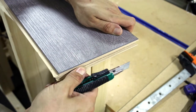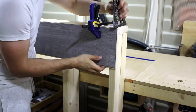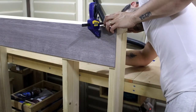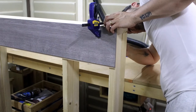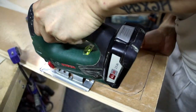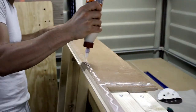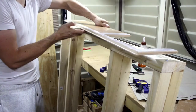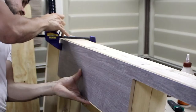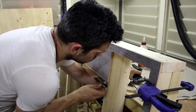When the structure was ready, I began gluing the laminate flooring to it, starting with the top row. After placing and holding it with a clamp in its final position, I simply outlined the structure onto the laminate floor — this will be the location of the shelf — and I cut out this area with my jigsaw. I glued it and waited for the glue to dry. For the top row I found it important to wait a bit longer, because if I had continued the other pieces could have pulled off the not yet dry pieces. I placed a couple of clamps underneath to prevent it from sliding down.